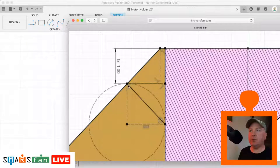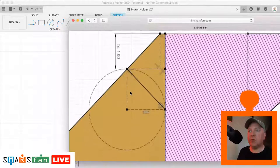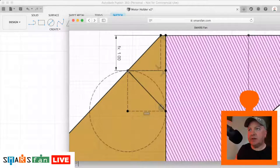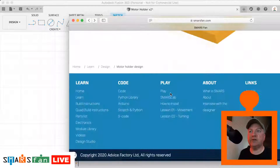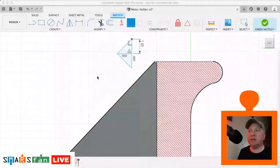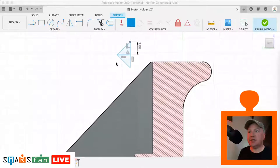And then what we want to do is just create, I'm just wondering why I used a circle for that. It's probably because I constrained it using a tangent constraint to the bottom point there, which is 1 millimeter from that point to that point in height, and then because of that we can just angle that back. We could just use a 45 degree angle. I think I was just using a novel approach there for creating that profile. Okay, so let's go back to that and let's just add in that extra bit of detail